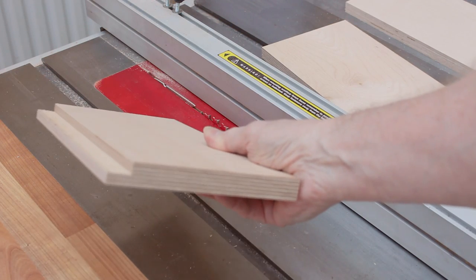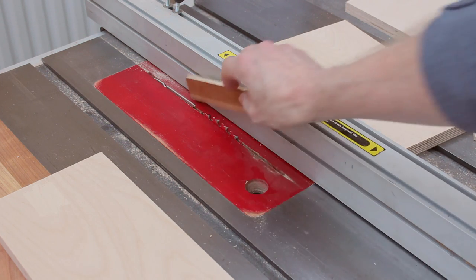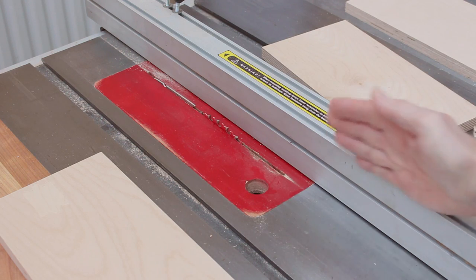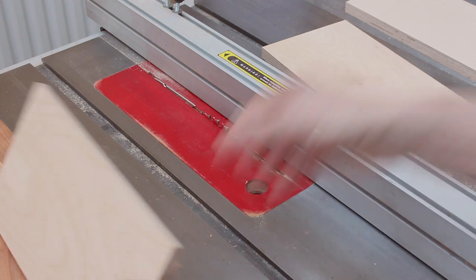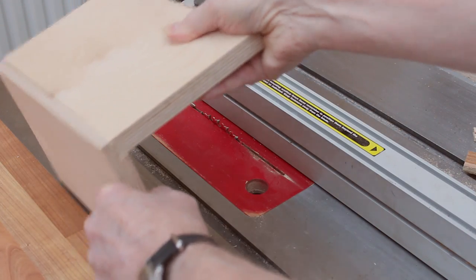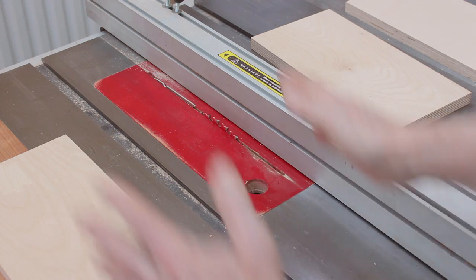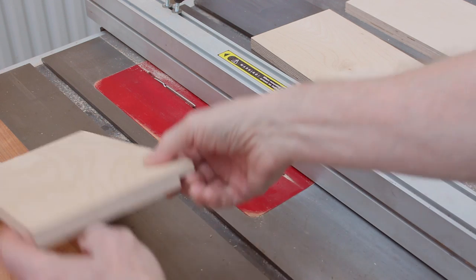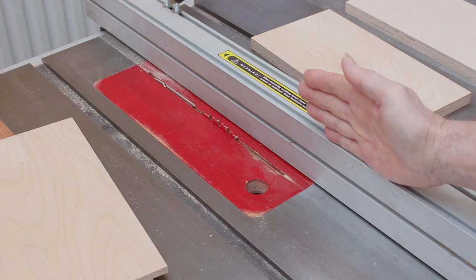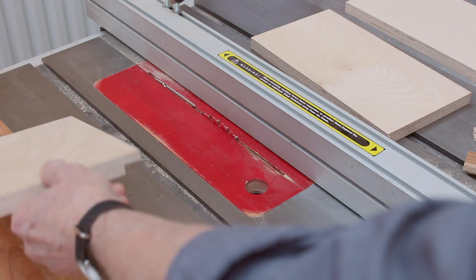I've made this test cut one little nibble at a time. I started with the rip fence right up against the blade — well, with a sacrificial fence in there — and then worked the rip fence out until I got a good fit. I've locked the rip fence at that setting and I'm going to run every piece through, making that innermost cut on them all. Then I'll start moving the rip fence back toward the blade, nibbling out the rest of the rebates.